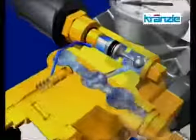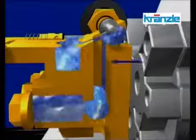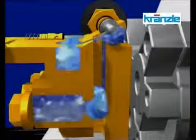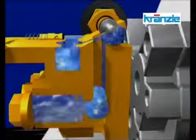The water now continues to flow through a kind of bypass in order to prevent any components from being damaged or destroyed by the prevailing high pressure. This principle is also used with pressure switch on equipment using total stop in order to switch off the motor.